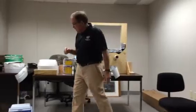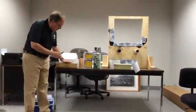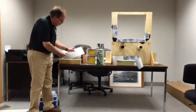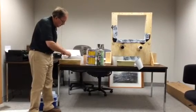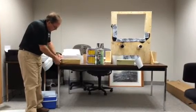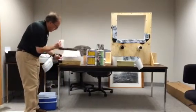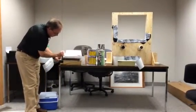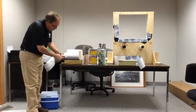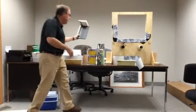Two other products we're going to show you. One is a dual guard, and this is used when you install on an opening, an entry door. This is a 1/4 inch foam. It comes in a roll like so. You roll very similar to what I did over here, but I bring it up against the jamb, the opening, and I coil this below, and then I come back with my sill and my pre-hung doors in lieu of caulking. And this is going to hold up for you in a tremendous way. That shows it from the inside. Here's your outside. And then you come back with your siding, and you've got a better seal than any caulk on the bottom of the door.